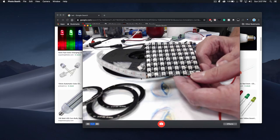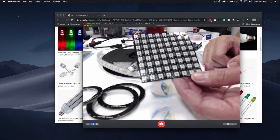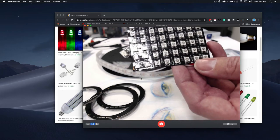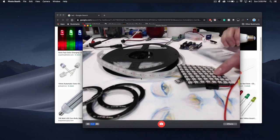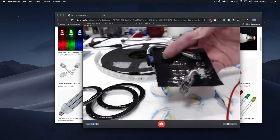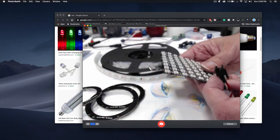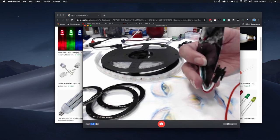How they work is you change the R, G, and B levels and it actually changes the color you get — it's kind of like color mixing. Inside each NeoPixel there is a red LED, a blue LED, and a green LED. By changing what percentage is on and off, you can actually get the different colors. This is an example of a grid bought from Blinky Labs. Blinky Labs is super interesting because they have their own controller built into it on the back.